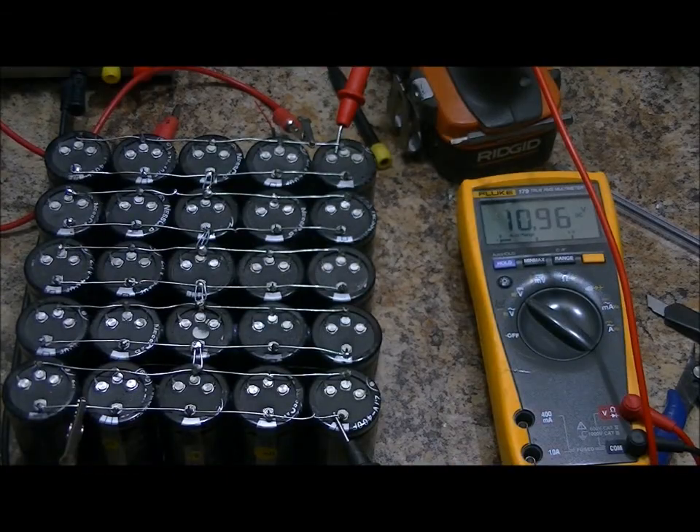A lot of power is being wasted here. Part of it is because I have all these capacitors in series, but mostly because these capacitors are damaged — I bought them used. When I played with them years ago before putting them in storage, I noticed they lost about 50% of their charge over a 24-hour period. I charged it to 12 volts, and we're already down to 10.82 volts, which is a significant loss considering we were charging at 5 amps.